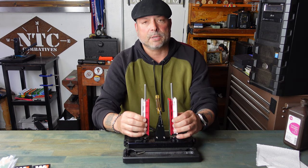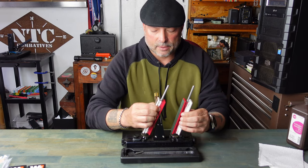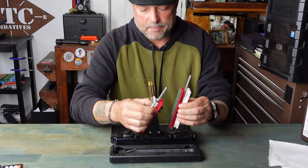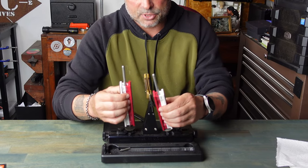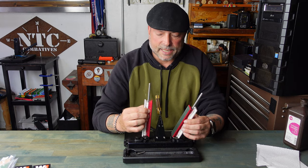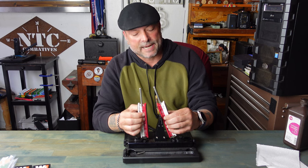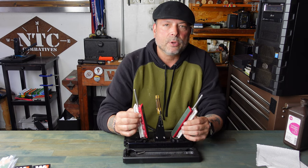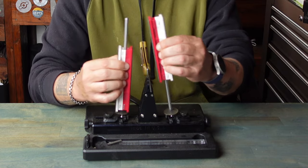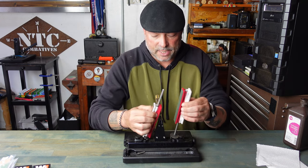You want to grab towards the top and that's where you want to apply your pressure, because if you apply pressure lower or in the middle you might end up scratching your blade. Just use this upstroke and walk towards the front of the blade, keeping safe. One side — we have one dominant hand that's usually going to be a little bit stronger than the other — and a lot of times that extra pressure is happening subconsciously. If you're right-hand dominant, you're going to apply more pressure on that side, so you want to make sure you're matching that on the left side. You want to put a little bit more pressure than you would with the more coarse stones, thinking about just denting that rubber a bit with each stroke, with equal pressure from both hands. Aim for anywhere between 20 and 30 strokes.